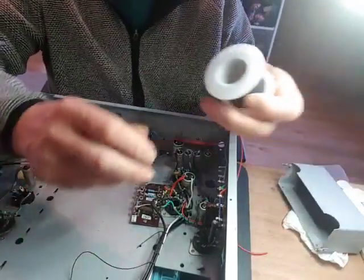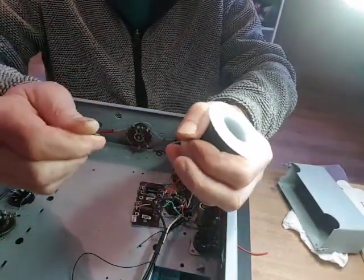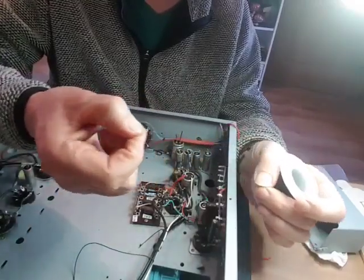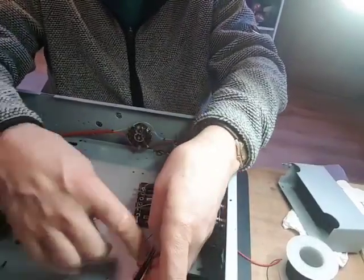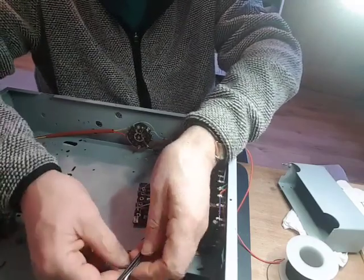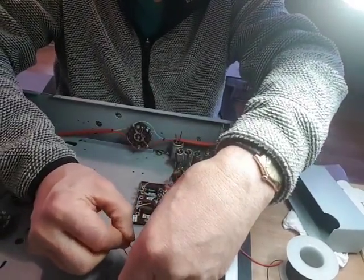This is something I've not done for a long, long time — not since I was an apprentice and got taught this stuff when we were repairing equipment. This is lacing cord. It's not wire — this is actually nylon. I remember the stuff I used to use was waxed nylon; this is more like PVC. As you can see, it's like a running stitch. I'm not going to go all the way to the end — I'm just keeping my hand in. It looks quite neat if you get it done properly, just a bit fiddly. Then you twist it back on itself to make a locking stitch.